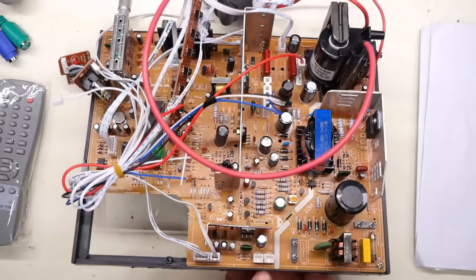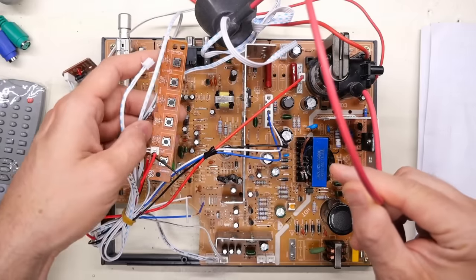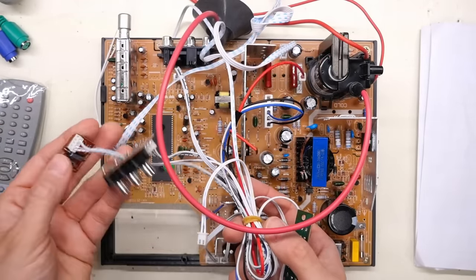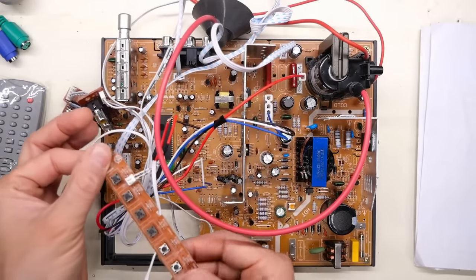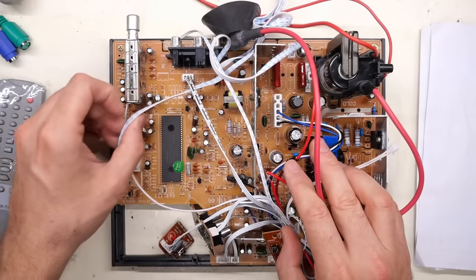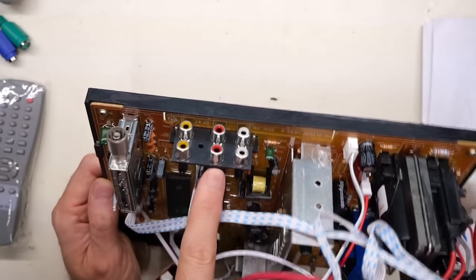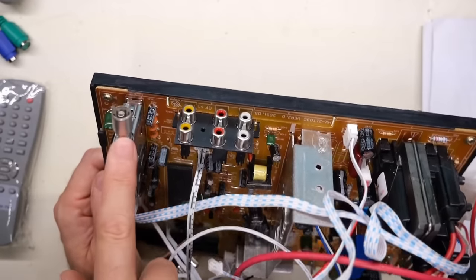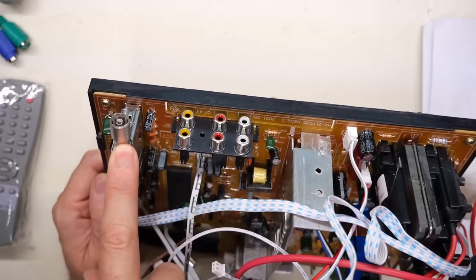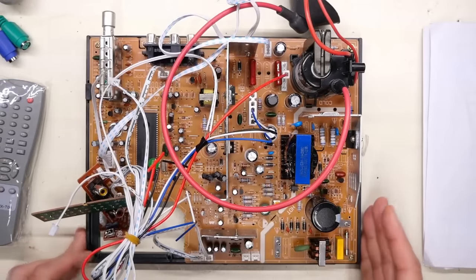It's pretty sure going to be mono even though there are two speaker outputs — there's just one audio amplifier chip with three pins, so that's a little bit of fakery going on. We have a front AV input on a little board, the IR receiver, and a little control board with just two wires using resistors. The main IC is that Toshiba part, and on the back we have AV inputs and a PAL tuner with a connector different from what we're used to in North America.